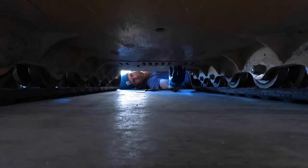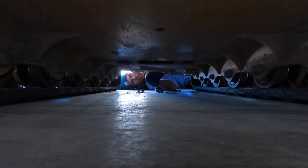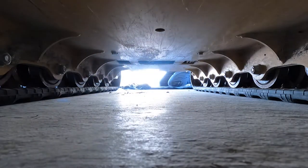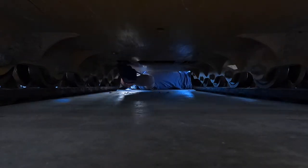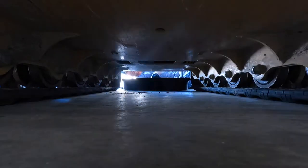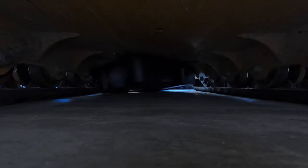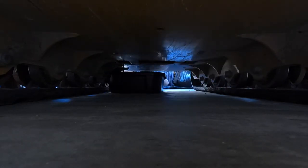Once we remove those two bolts, the plate will slide out — it hangs on a little lip. Then we'll bring in the deep socket, feel out the location with our hand, and blindly get the socket onto the drain bolt and break it free. We have to position the oil pan underneath, then get our hand in there to finish removing the bolt and let it drain.